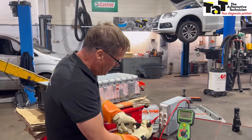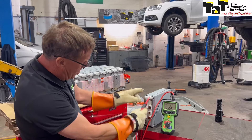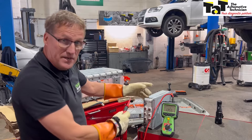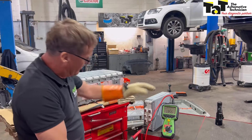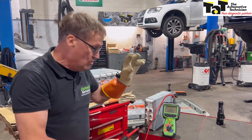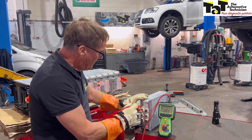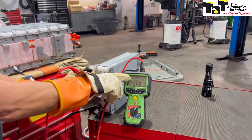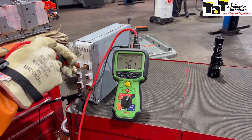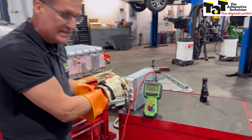If we go back to the actual faulty cell we've replaced, we've got two batteries in this one block, and that's the way it's numbered in your PID data as well. There are 96 of them, and this block is actually housing two batteries. We've got the good side and the bad side. If we go to the good side and press the test, we can see that we go straight to 1,000 volts and again increasing resistance over time, which is what we want to see — which is basically what a DAR test is.